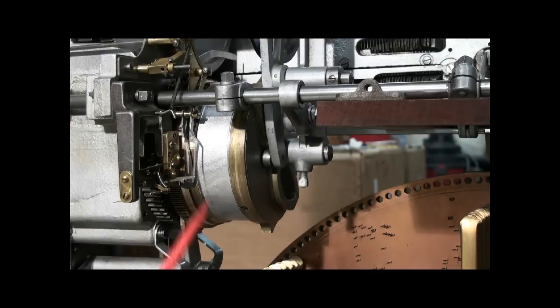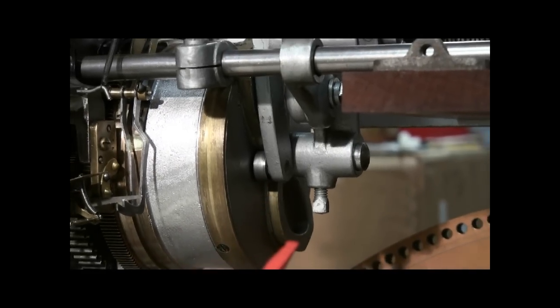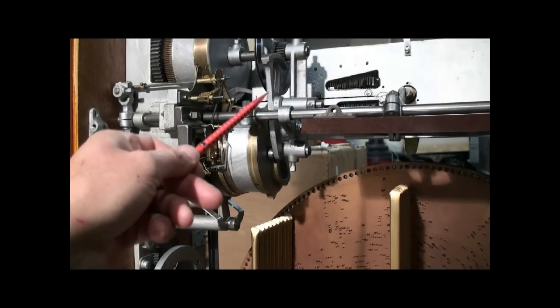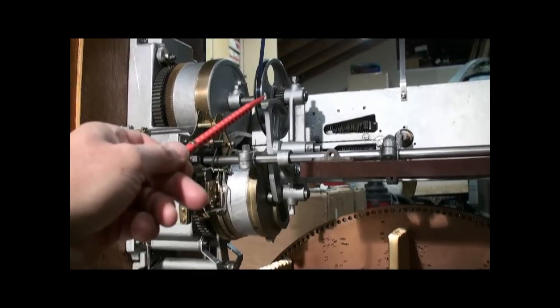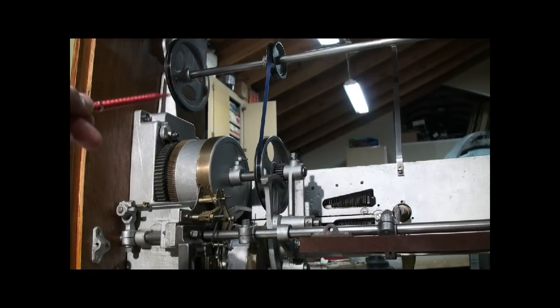As the motor continues to rotate, the next thing that happens is that this roller bearing moves up onto this pattern, which pushes the bearing and this arm outwards towards the edge of the motor. And as it's pushing outwards, it's going up and acting on a gear, and that gear is driving this pulley. The pulley goes up and over to the lifting arms.